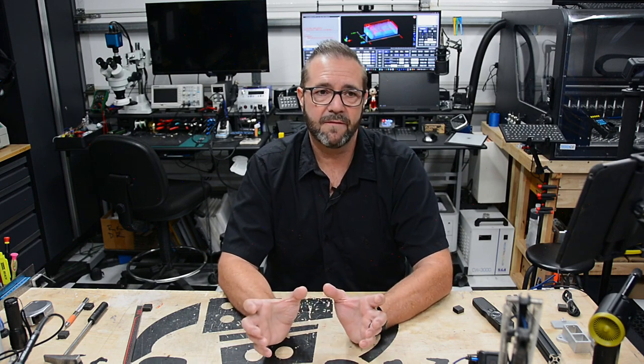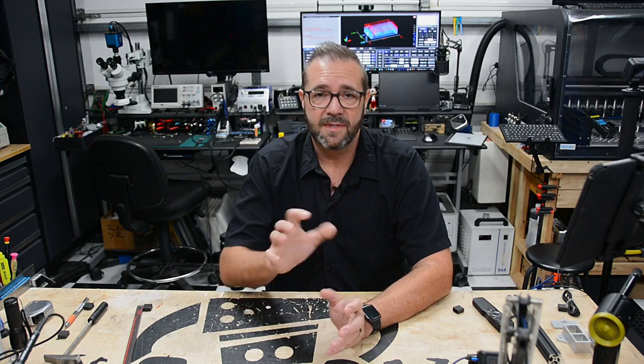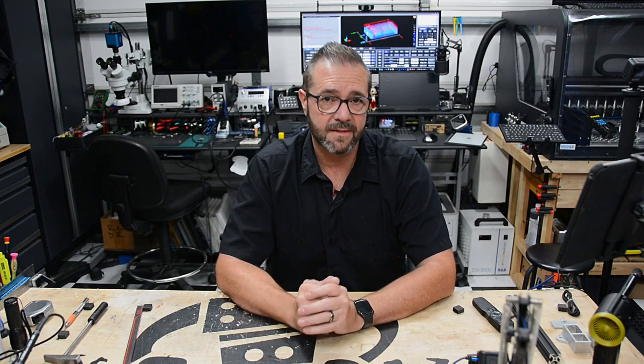From a hardware perspective, you immediately will need to upgrade the platform to something like the Saunders machine fixture plates and a ModVise system to give you some enhanced accuracy and precision to hold tighter tolerances. Changing your tools often on complex operations will leave you busting your knuckles with the collet wrenches and constantly touching off for your tool length offsets. And that, for one, leaves you wanting an ATC or being able to streamline that.